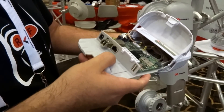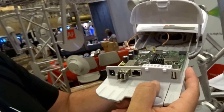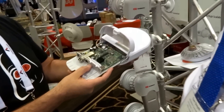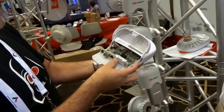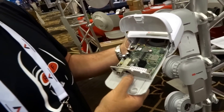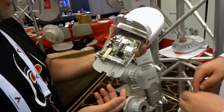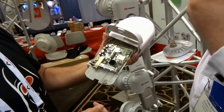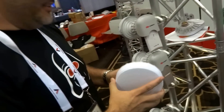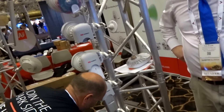This is our MikroTik version, which has a RouterBoard inside. You can see the antenna element in there along with our MMCX connectors. You can connect this to any 911, 711, or 411 board with R52HN or R50 Pro, or a Ubiquiti radio. We also have SFP support on this particular 921. It's really easy to put together — just four screws hold the board in and you're done. LEDs come through so you can do alignment. It comes in shielded and unshielded, so it's up to the customer.